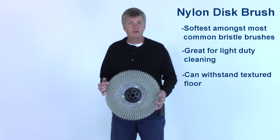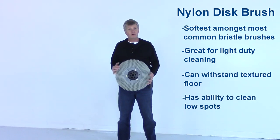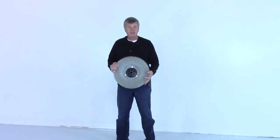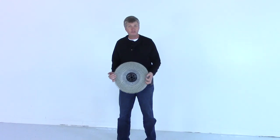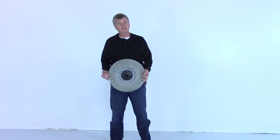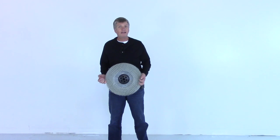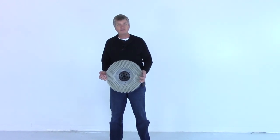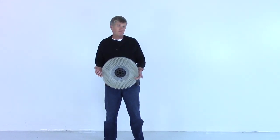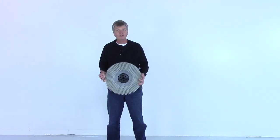Also, a lot of floor surfaces are uneven. If the floor surface is uneven, a pad will tend to skip over the low spots, whereas a brush has a better chance of getting down into the low spots and cleaning. What I like about a soft brush versus a pad is we don't have to change them as often. Sometimes operators forget pads are underneath the machine, don't change them, and eventually the pad driver starts scratching the floor. A brush lasts much longer — you can get over a hundred hours out of one, and the operator doesn't have to worry about changing it.